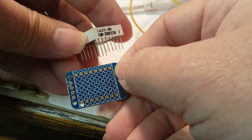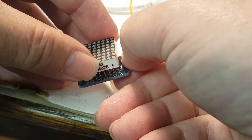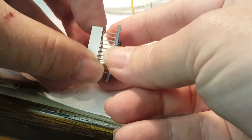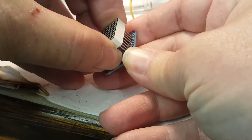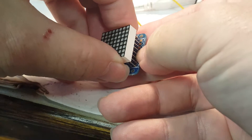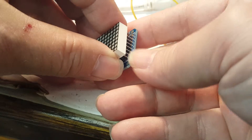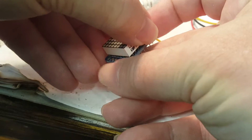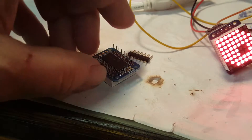The writing is right here — we put this together on that side. Sometimes the pins don't want to line up and don't want to drop in on the back. You can try to wiggle it around, but usually you end up having to look at the individual pins and push or pull on them until it finally drops through. Just to verify: filled-in pad right there, writing on the same side.